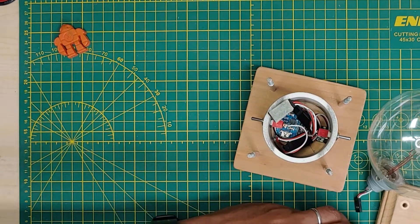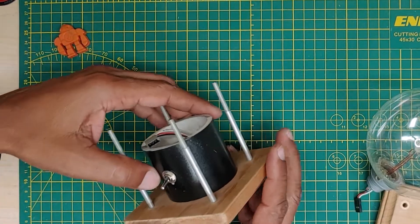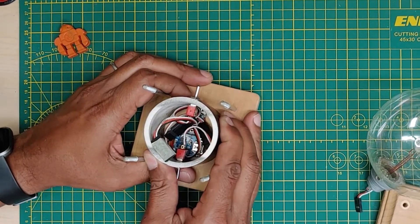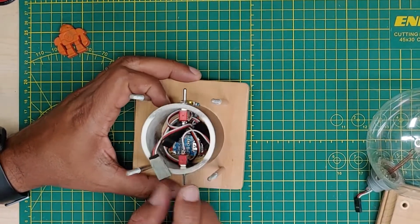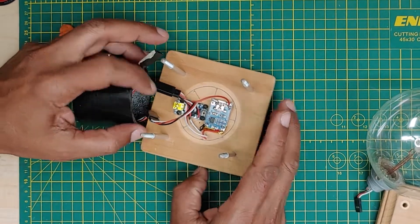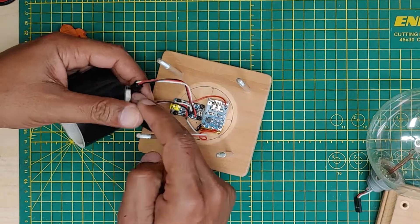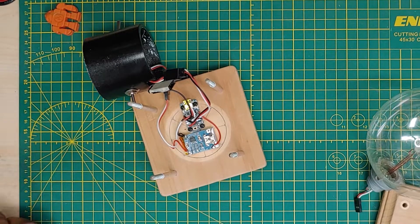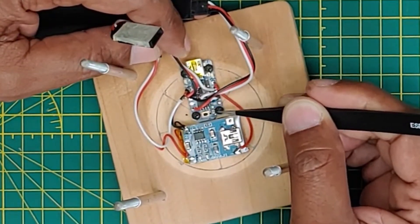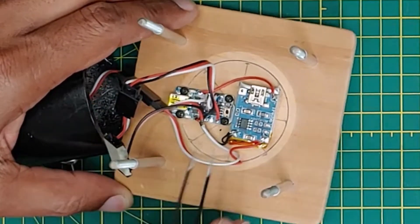Let's look at the inside, which is where all the crazy stuff happens. Like I said, this is a threaded rod, so we won't pull all of that out — we'll just take the center tube out. This is not glued in there; the pressure just holds all of that together. You can see how the switches are wired in here. What's actually in here is a small Arduino microcontroller. Let's untangle this so you can get a good look at that. Small Arduino microcontroller down here — and this is a Trinket. This is an older microcontroller.